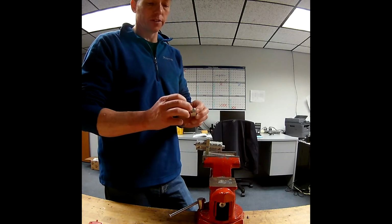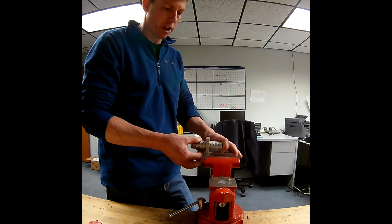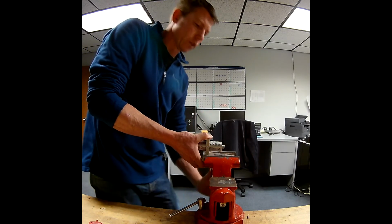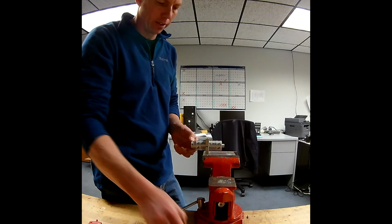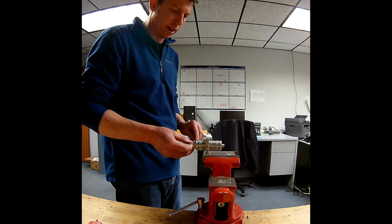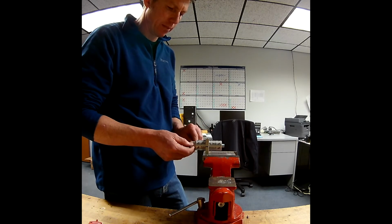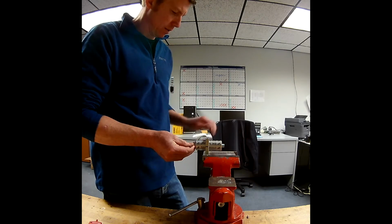Wand holder, there is a collar, basically it's a collar that goes onto the scanner motor shaft. We're going to leave that loose for now so we can get a proper balance on this wand. It allows it to kind of float freely on there. Stick that, the wand and the pin back through the scanner.